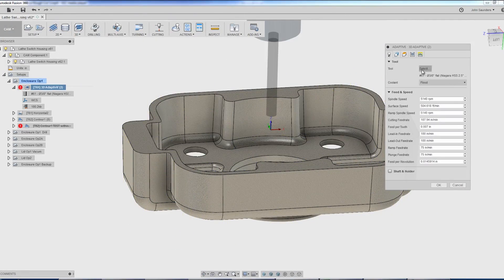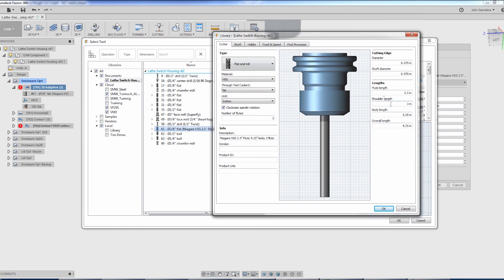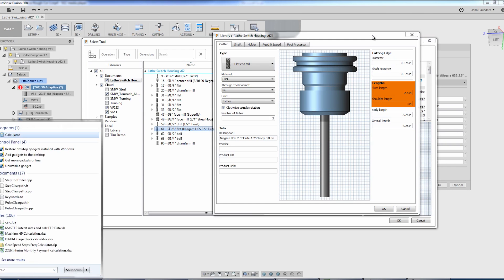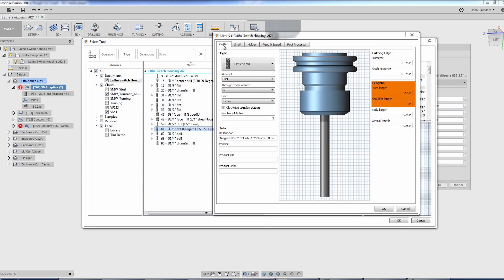The recipe is adaptive with a long tool. It's a three-eighth inch diameter tool with a two-and-a-half inch flute length and a three inch shoulder length. The rule of thumb on stick-out has to do with how long the tool is relative to diameter. Three inches long divided by 0.375 means we're at eight times diameter. That's long — three or four times diameter is usually okay, so this is pretty crazy. Luckily, REN board isn't too difficult to machine, so I think we'll be okay.